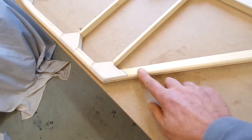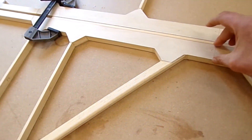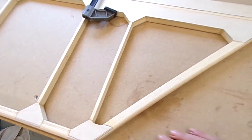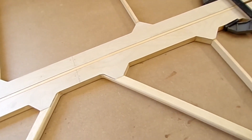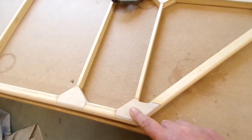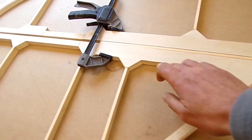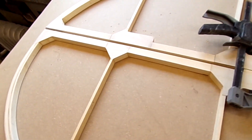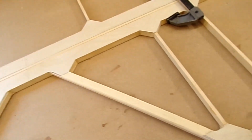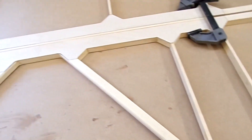As discussed, I lightly round here to try and keep as much material in, as the torque being transferred from the horn — which would be affixed to the spar — is transferred out to the trailing edge through these sections and through the ribs. So trying to keep this lot strong — these joints here really are critical joints for transferring that load, along with all the joints against the spar. So make sure you take your time to make those joints as good as possible. Not quite so critical out here on the trailing edge, but still full strength — good to make as best as you can.